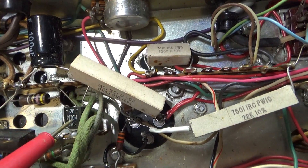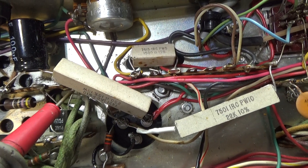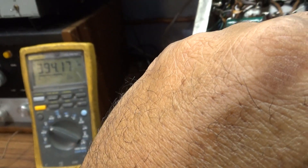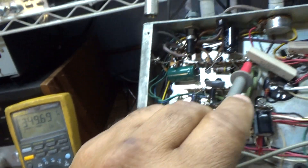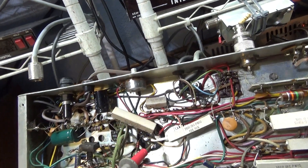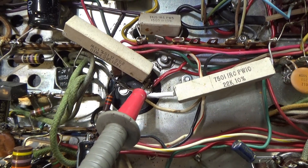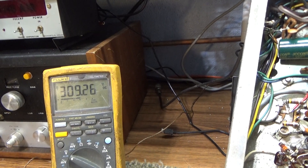We're going to measure the voltages quickly. Starting right here at the junction with the two high voltage diodes and this resistor — if I can get a good contact — I got 400 volts unkeyed, keyed it down and it dropped to 345. Anywhere around there is fine because it doesn't take a lot to key the relay.